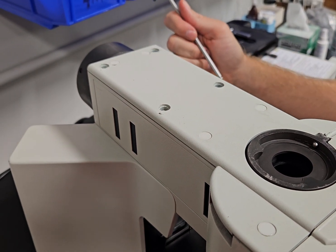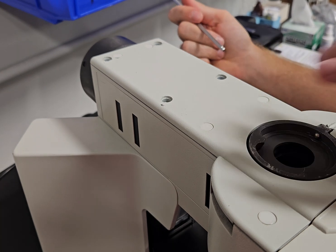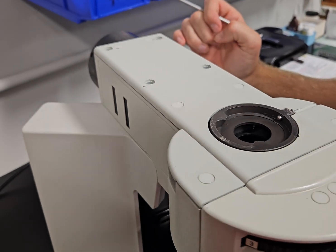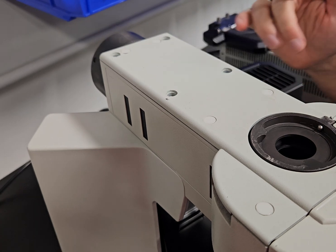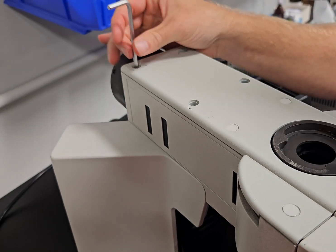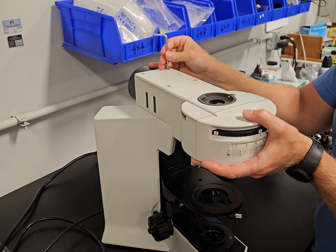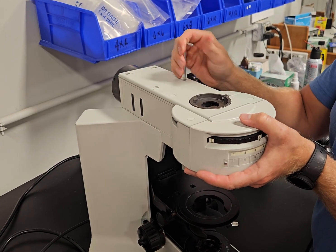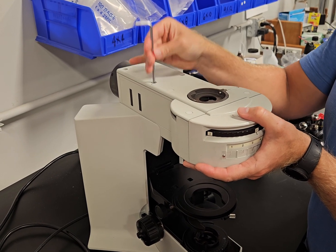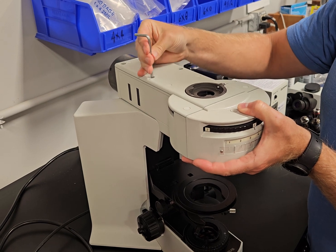The reason this is important is a lot of times when we ship this, to make sure it gets there safely, we'll take this off. Sometimes depending on where it's going — if it's going overseas we always take it off; if it's going domestically sometimes we'll leave it on. We're going to show you how to take it off and put it back on. We have another short video on this, but if you ever want to upgrade your scope to fluorescence and need to add one of these, it'll be helpful to know. So you take the four millimeter Allen wrench and back these screws off. I would definitely recommend taking the head off and the nosepiece off before you do this — the nosepiece is connected to the illuminator — so less weight and less things to get damaged if you drop it. Loosen all these screws.